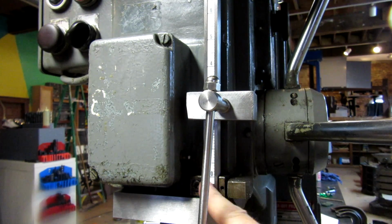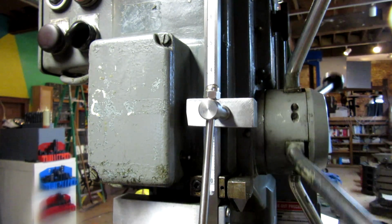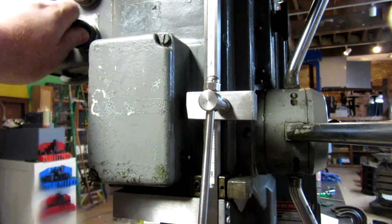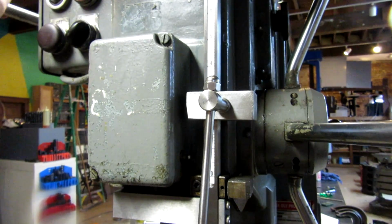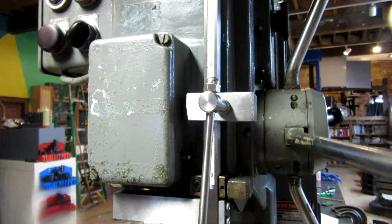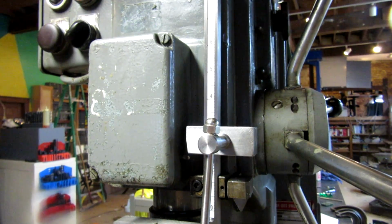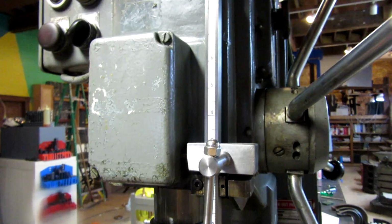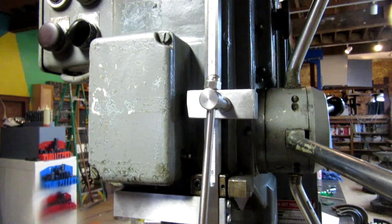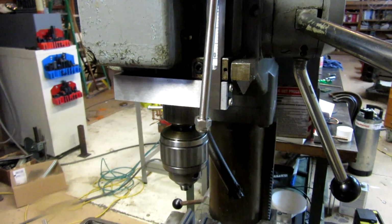So if you watch here, watch the slope. Here's the switch. I'll tell you what I'll do. We will demo here. Let's take this drill bit out. Alrighty, put it in, make sure it's in tap mode. So we're in tapping cycle mode. You lower the tap down, it engages the work, reverses, comes back up to the top. Let's get a better angle. There you go.